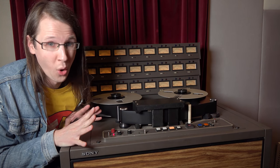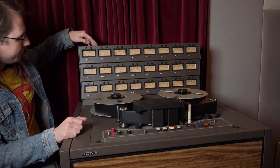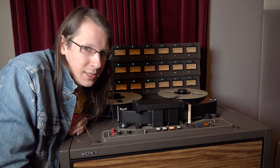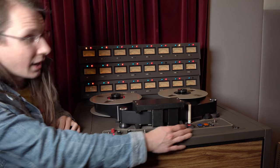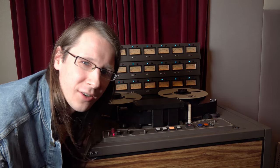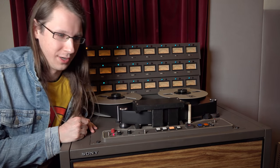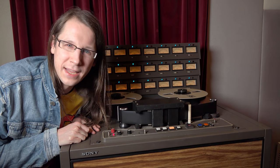Those are the basic controls, but there's way more to know about such a machine. The VU meters have lights: blue lights mean you're listening to the input of the tape machine — it's practically bypassed. Red lights mean you're recording on that channel. There's also a broken light I'd rather not talk about, since it's pretty difficult to replace.